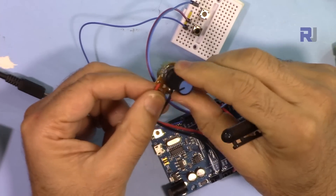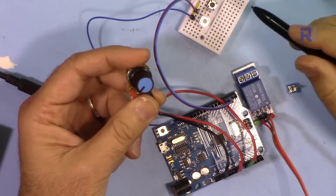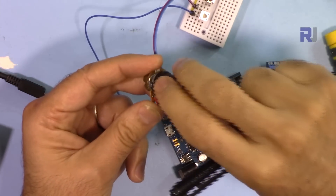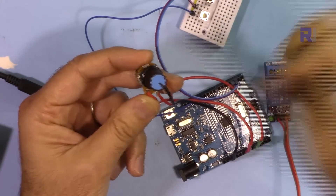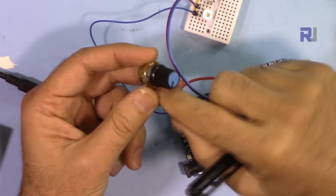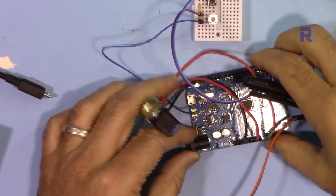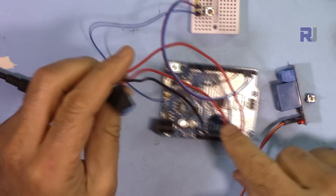I've put a knob on it and the minimum and maximum are clear. In the code you set your minimum and maximum — the minimum voltage read on analog pin 0 sets the minimum time, and maximum voltage sets the maximum time. For example, if you set maximum to 10 seconds and minimum to 5 seconds, the range is 5 to 10 seconds. You can set it to virtually any value, up to 100 hours or more. Once you upload the code, disconnect from the computer, supply power, and the device will independently work with the potentiometer.